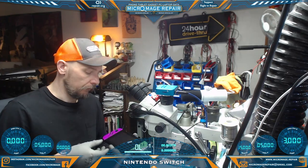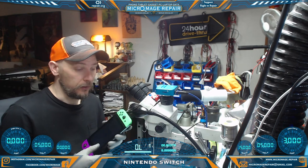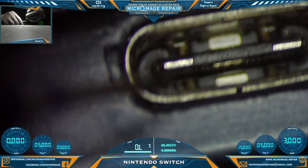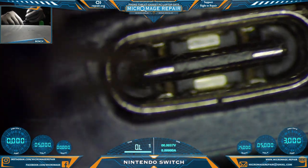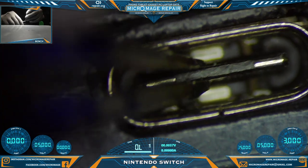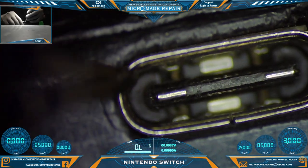Nintendo Switch. Okay, the problem with this one is not as obvious as you'd expect. Looking at this port straight away, you'd say, no problem. It looks fine. However, if you get in here, you'll see that shouldn't be moving at all. And then that shouldn't be moving at all either. So